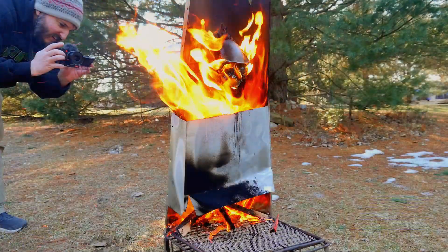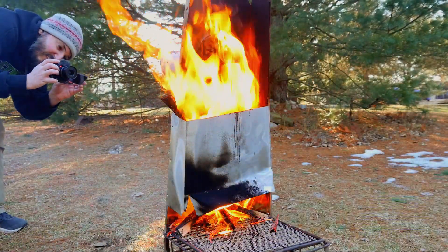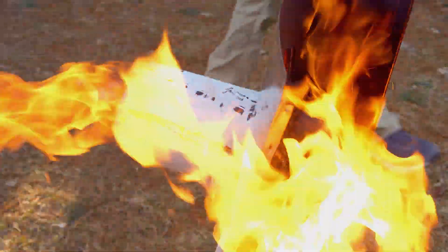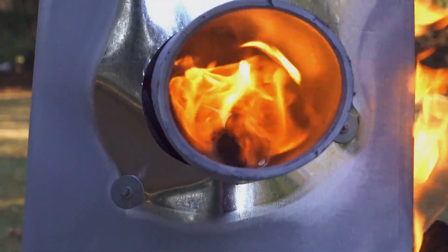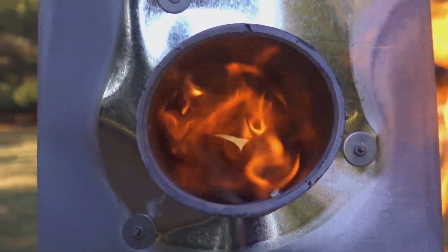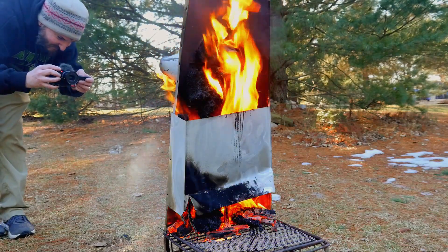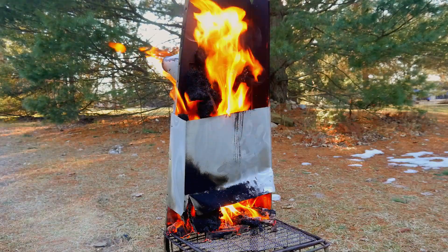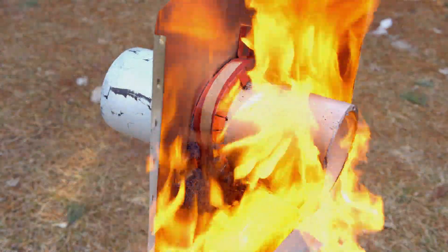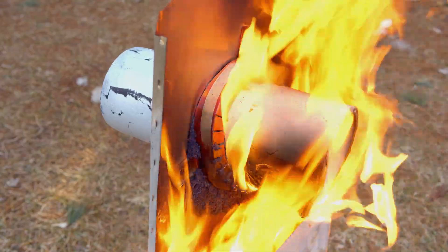My test of this 4-inch collar has not ended up quite as successful. Between the larger size, the more flammable and short length of pipe, and the unidirectional application of heat, the result has not gone to plan. We did end up with about a 50% restriction of the pipe even under these bad circumstances before the whole thing caught fire, which is pretty good. I would definitely trust this collar if it were mounted to a sturdier wall, although it would probably benefit from more than three screws holding it on. Four or five screws would have greatly reduced how large of a gap was able to open, which allowed the expanding graphite to escape.